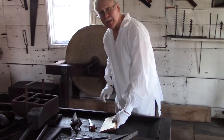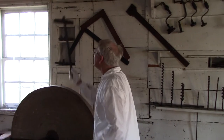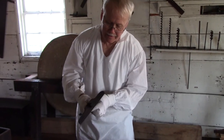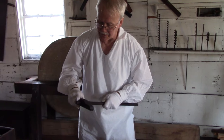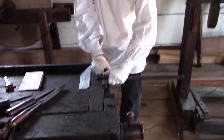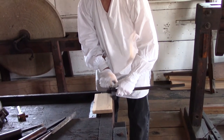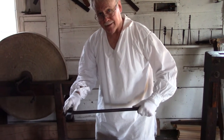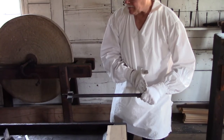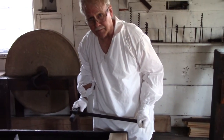If I wanted something bigger yet on a marking gauge, I can use this. There is a thumb screw missing here, but you have your point. It's set at about an inch right here — I would be able to mark it an inch in. But if I wanted to mark 16 inches in, I don't want to force it — but this could go up to about 16 inches, and I can mark something on a larger scale.